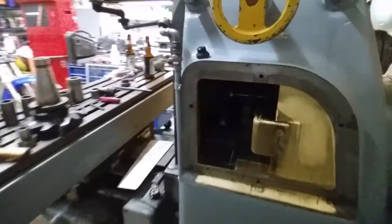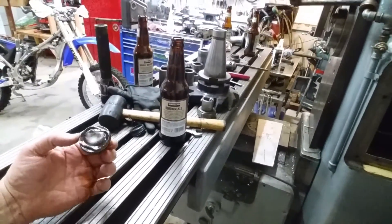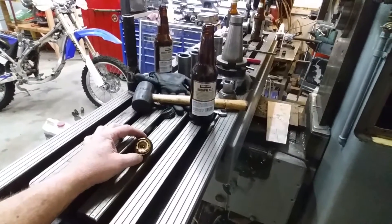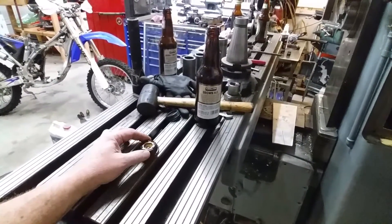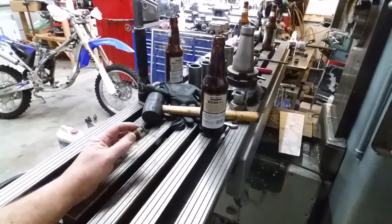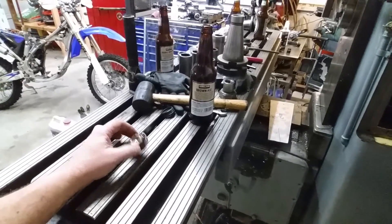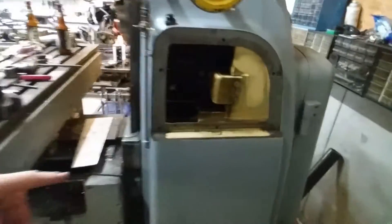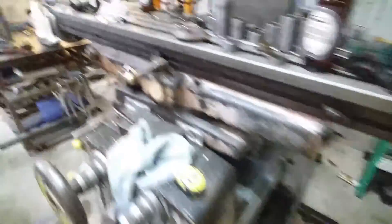Where I'm at right now is shopping around here and there for these sight glass windows. They're plastic, old, and nasty. I'm trying to find some sight glass windows online that'll thread directly into this machine. They look to be an imperial size but I haven't confirmed — I'm going to cut a piece and try to fit it. If I can't find what I need online, I'll make some bushings and buy some sight glasses online and just screw those in, so I can check things like oil flow and oil level. I've got one here, one here, one here to make, and one over here to make.